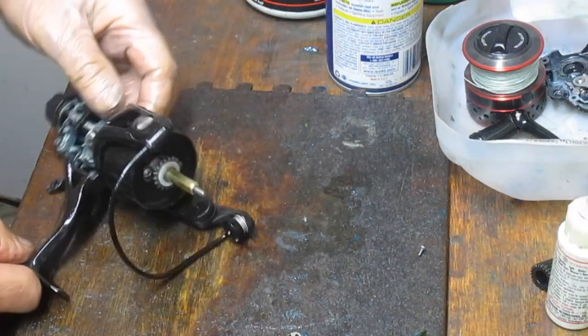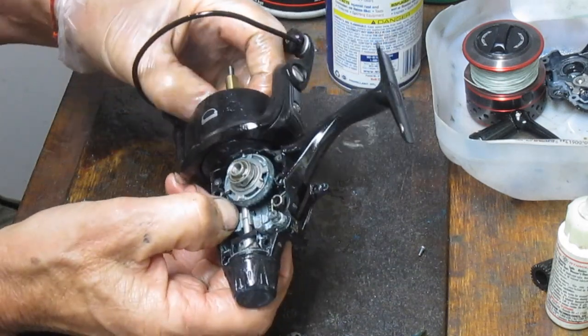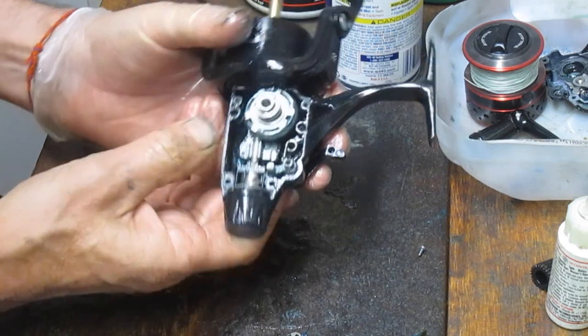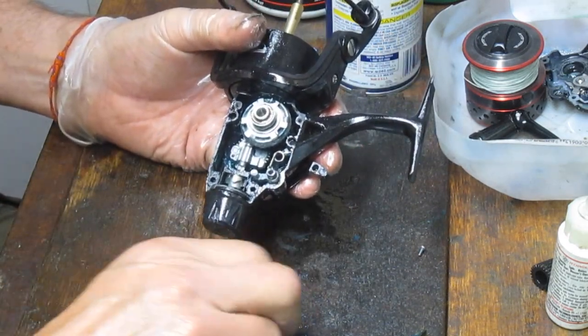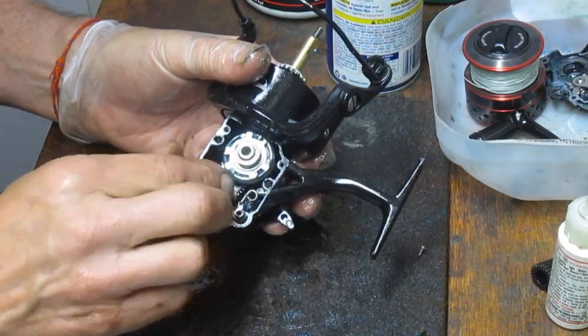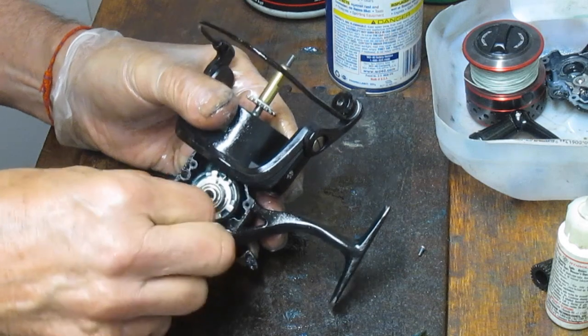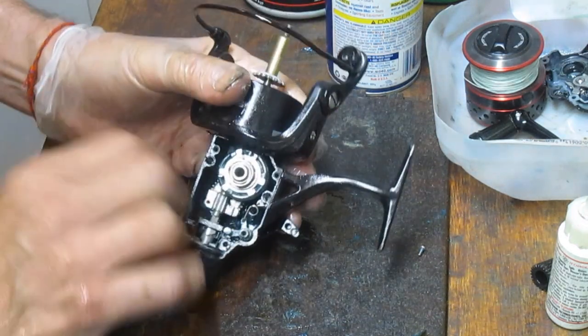And then what you want to do after you put the axle shaft in, you see how it rides through that crosswind block. You want to bring the slots up so they're on both sides of the crosswind block. And then remember, this goes hooks from underneath, and then presses down. And then it's fun times with little screws.